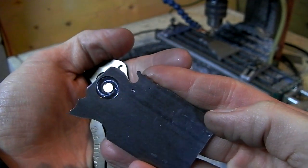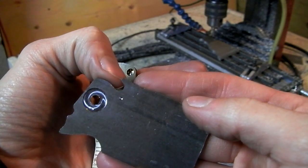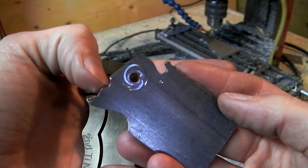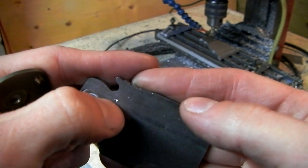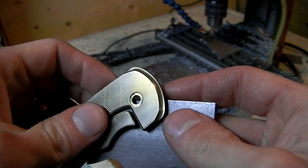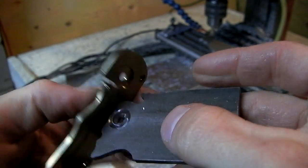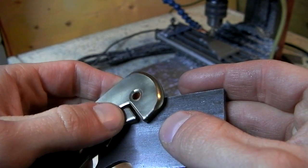And I just finished my first dummy blade. So by my thumb is the stop pin section. This here is the closed stop pin section. Here's my detent hole. It's a 1/16 hole. Remember, the ball is 1/16 bigger than that. See if I can line them up here. If I can find it. There. Ooh. Fits nice.